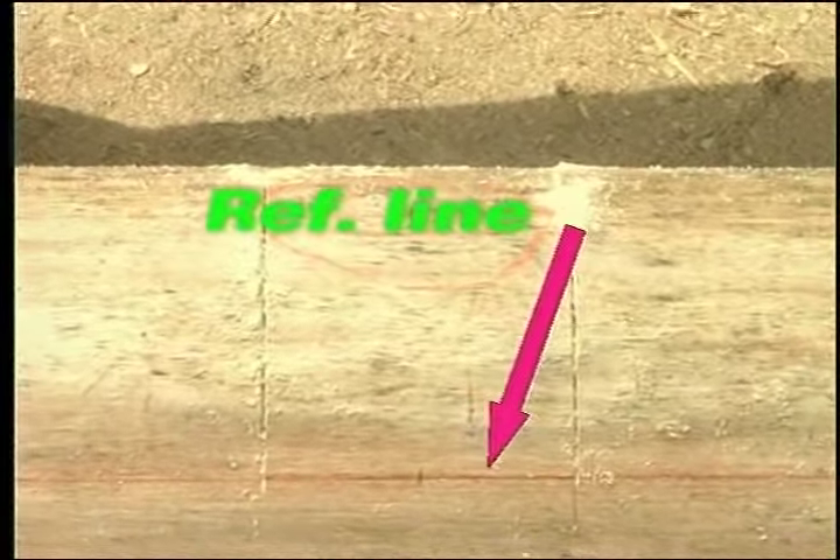Prepare the post logs by flattening them on each side to a width that will be equal to the framing material plus the sheathing to be used — let's say 150 millimeters or 6 inches. The width of the post itself can be a random measurement. Make sure that the post is long enough. From center lines, place a cut line around the top of the post about 100 millimeters from the end.